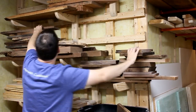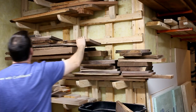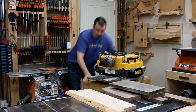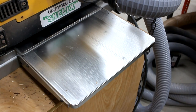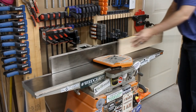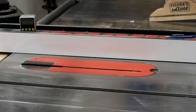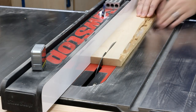My intention is to create all three of these pieces as end grain boards. This adds a bit more complexity since I have to plan ahead so that once I turn the individual pieces on end, the design will reveal itself. I start off by picking out some rough-sawn walnut, some maple, and a little bit of cherry. I hook up the planer and put a smooth face on each piece. At the jointer, I run each piece over a few times to square up one of the edges. This makes cutting the individual strips to width much easier on the table saw since I can reference those square edges against the fence.